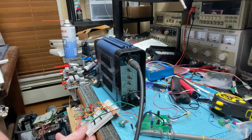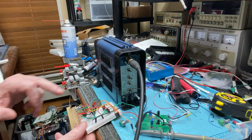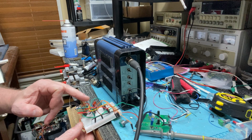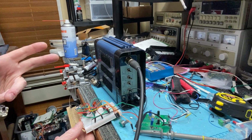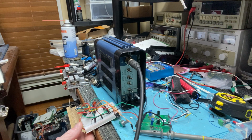Positive voltage goes on pin 7, negative voltage on pin 4, and output voltage on pin 6. I've got a capacitor across it just to get rid of some of the noise, or that capacitor might actually be on the output of the Hall effect device. I should have one there as well. I haven't, bad luck. Feedback resistor there, I think I've got 100k in there or something like that.